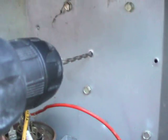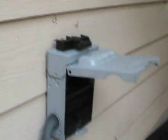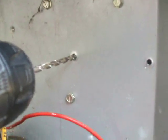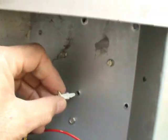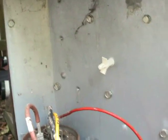I'm going to start with the 9/64ths bit, because I don't want to oversize this hole. There it goes. By the way, for those of you who are wondering, I do have the power off. Let's see if this fits now — no, not really, still a little bit too small of a hole. Now I'm going to try a 5/32nds drill bit here. Yeah, that's perfect.